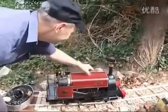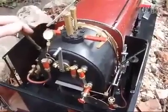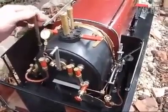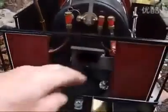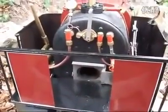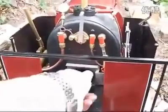Is that a little wet? Right, just pumping water into the boiler until we've got about half a gauge glass full. Then we can think about lighting up. This is charcoal soaked in BBQ lighting fluid and we're using this just to get the fire lit.